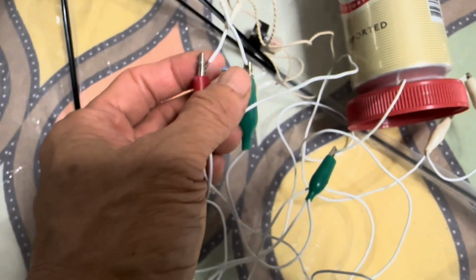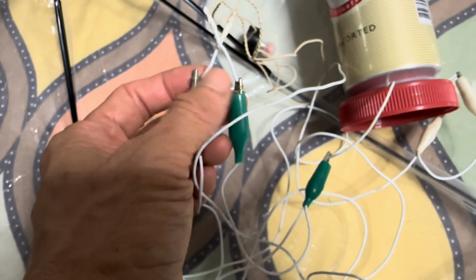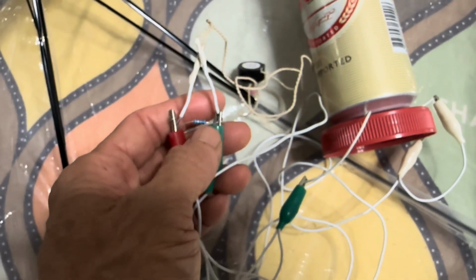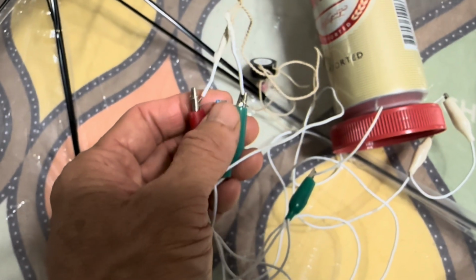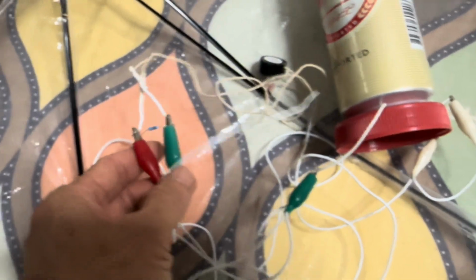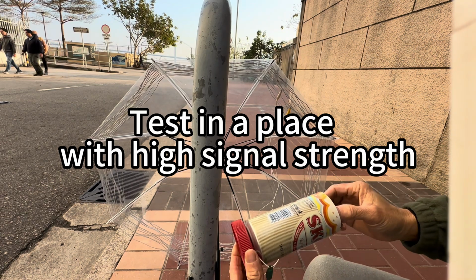In certain situations, you can bypass or skip this resistor. That is, if there's already some leakage current going on. Well, it depends on the situation. To be safe, you can always put the 200k ohm resistor across the two terminals. We can even replace the diode with some self-made detector, like the foxhole radio detector using a razor blade and a pencil. Let's start some field tests.